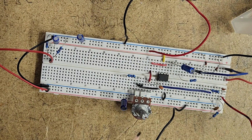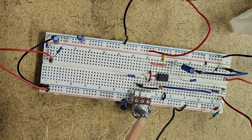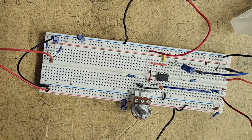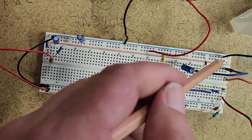So on the Tube Screamer, all my ins and outs were on one side, whereas on this one, we've got the out actually coming out of the other side of the op amp, so I've had to jump that around here. But we're going in, and then here's your feedback loop with your potentiometer, and then this resistor going to ground. I've chosen to omit that pair of resistors and pair of capacitors. I'm not sure why they did it in pairs. I just used the formula for resistors and capacitors in parallel and used something of similar value, especially for this example. It makes it a little bit cleaner. And then we're going out, comes out, and then through just this filtering capacitor, and then here are our two diodes going to ground.